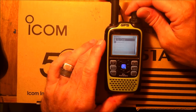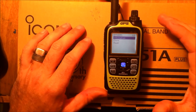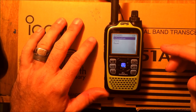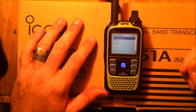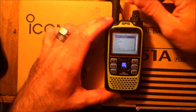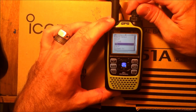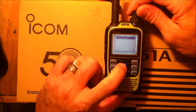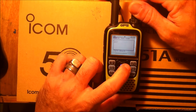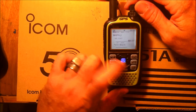You can clone the radio. If you have a buddy with a 51 that has everything in there, you can clone from your radio to his or his to yours, put all those features on there and you're ready to go. In the quick menu at the bottom there are quick functions — instead of going through all the menus you can set your shift, your tone, tone squelch, DTMF transmit. For direct input, if I want to do 22.5, I can set that up as DTMF without having a keypad, so it's not a big deal to have no keypad in the front.